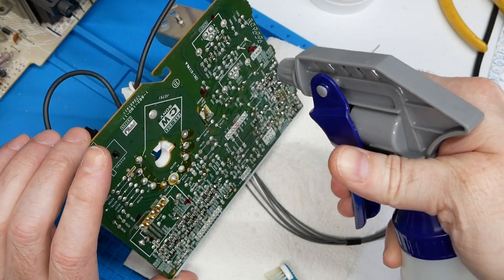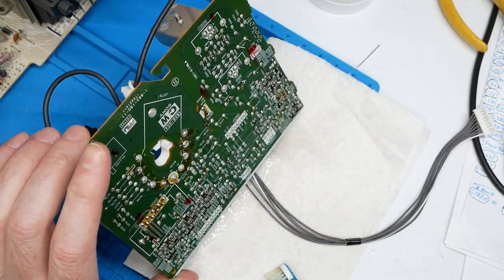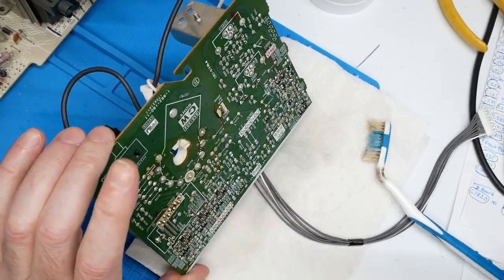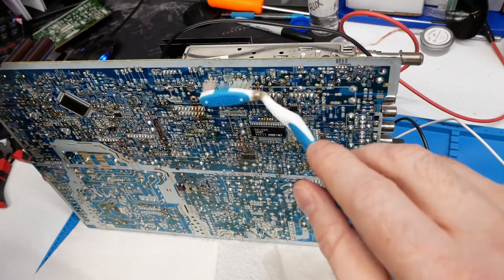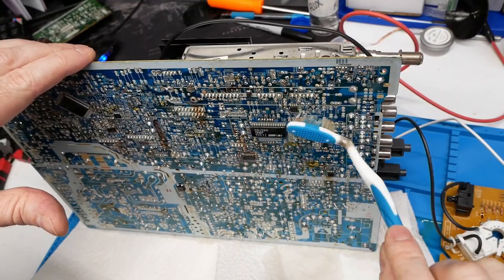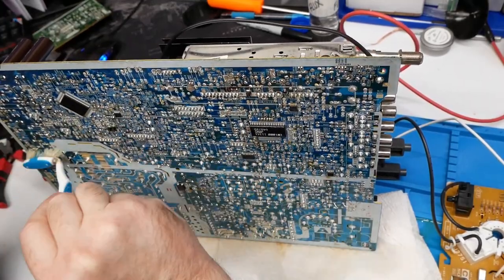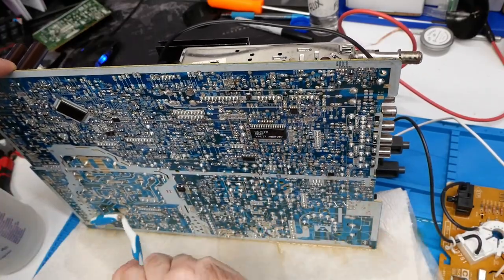Here's the part I hate the most — giving everything a bath using 92% isopropyl alcohol. I've got to try out some different fluxes. I'm using a rosin-based paste and that stuff is just sticky as hell even after you squirt it down several times — it leaves a nasty sticky residue, it doesn't come off your hands, it doesn't come off the board. But it serves its purpose and works well, so if you have any suggestions for a different flux leave a comment.